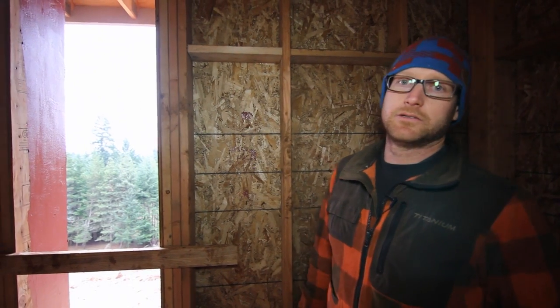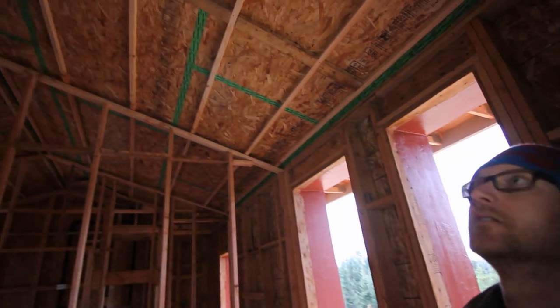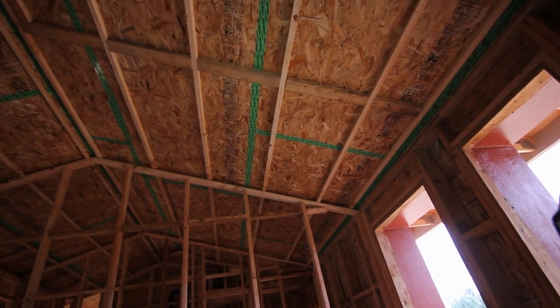In order to accommodate our ceiling light fixtures, we nailed up two-by-twos for a small service chase, basically just for the electrician for wiring. We'll have no recessed cans in this ceiling assembly — just surface-mounted lighting. They'll have a lot of pendants, some fans, and some other fixtures. You can see at the ridge here we have a light block, which I think is for a fan in this case.